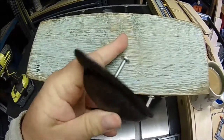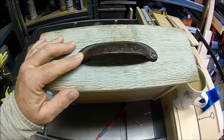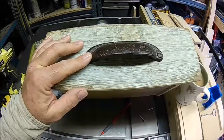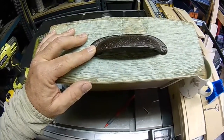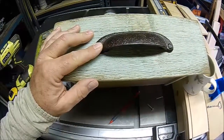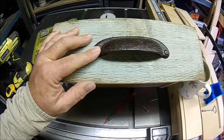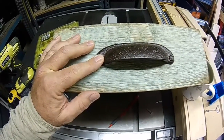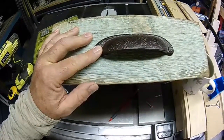I'm going to measure the distance between the screws, mark my drawer front, drill them out, and get them installed. The downside with this set of hardware is it doesn't come with a template to drill the holes for these cup pulls, so your very first one takes some time. To get it centered, you have to take into account the width and length of the cup pull itself, and where the screws will anchor into the back to hold it tight.